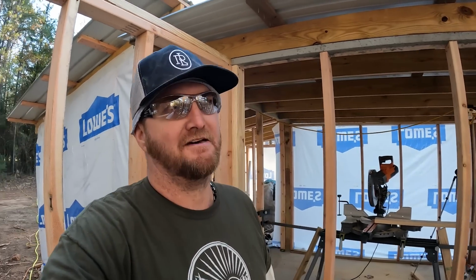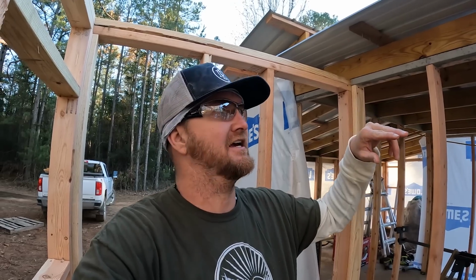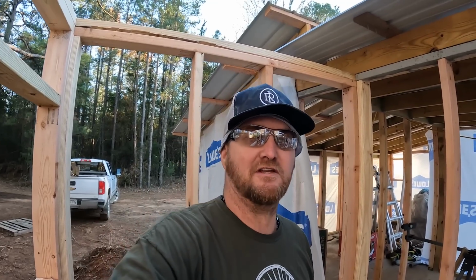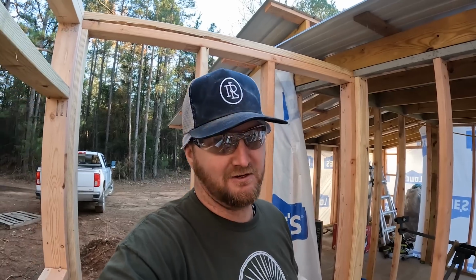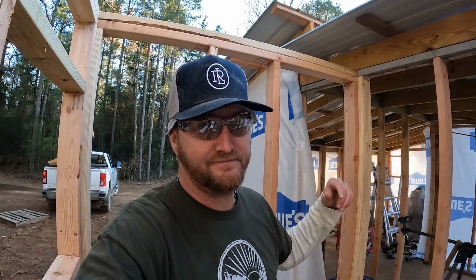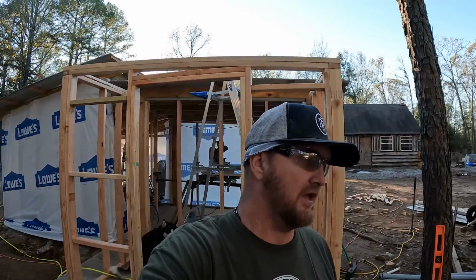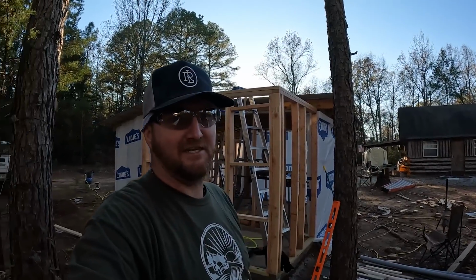So now all we got left to do is put the 2x6s up, put our blocking in between it, and go ahead and put our 1x4s across and put our metal on. But I don't think we're gonna get to all of that until in the morning. Then we'll get those 2x6s up there and get some metal on there, and then I should be able to close this building completely off with the house wrap and go ahead and cut out the doors and start putting the windows in. We're making progress, guys. But I'll see you in the morning.